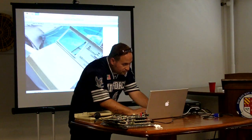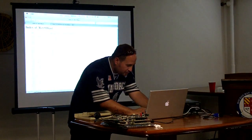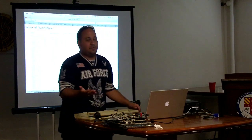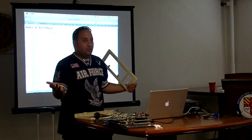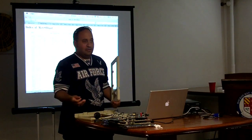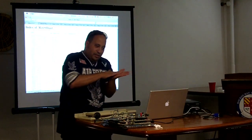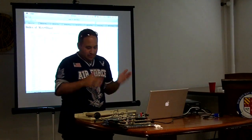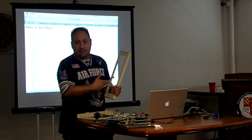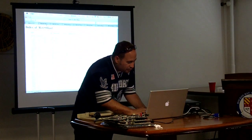Now, is it just the impact of the baking soda that it's happening, or is there anything chemical happening? No, it's just literally impact. It's just abrasive cleaner. It's almost like taking Ajax or a Comet and just going for it. But you can't do it with that chemical. But no, that's also abrasive. That stuff's great. But if you start doing this with Ajax and Comet, you're going to end up with friction and heat. Again, sitting here with the air blaster going on this, it doesn't heat up. The pieces are just small enough.